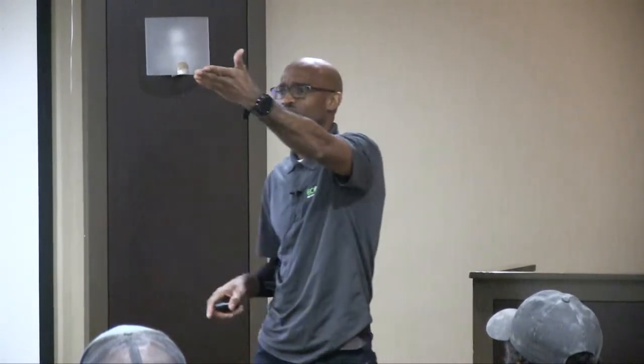So every one of these units, and this is my public service announcement to you guys, not just for our product, but for any inverter type products, a ductless mini split, a VRF system, always put a surge protector at your outdoor unit disconnect. They have these point of use surge protectors, not very expensive. You guys have them? Less than $60, depending on how crazy you want to get.